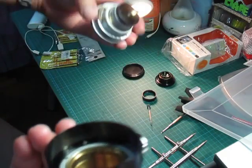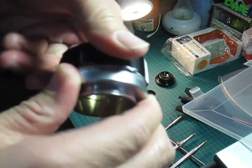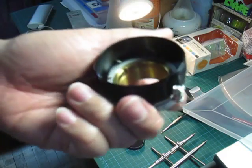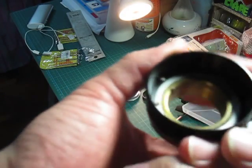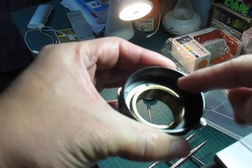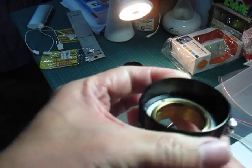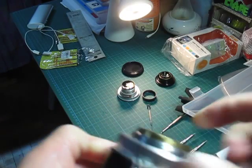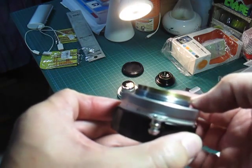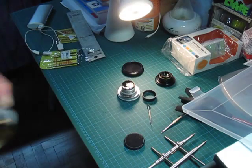This is the metal shell that controls the focusing mechanism — there's no glass here, just the lens body. The gold part contains the thread for focusing. So if you want to lubricate the lens, you just put a tiny bit of lubricant onto the gold thread here, then twist it clockwise and counterclockwise to work the lubricant in. As I'm focusing it, it goes in and out. Just a tiny bit will do — if not, the focusing becomes too soft.